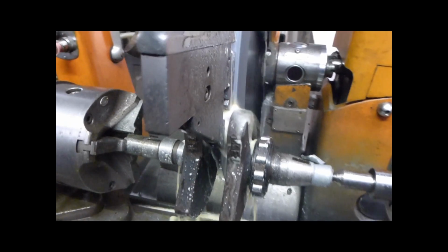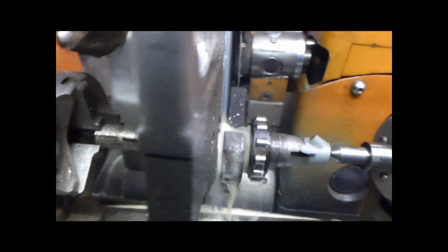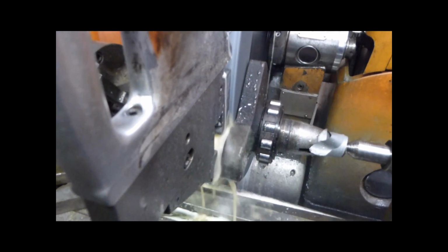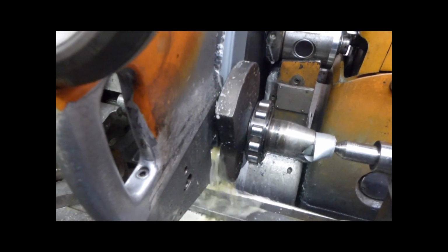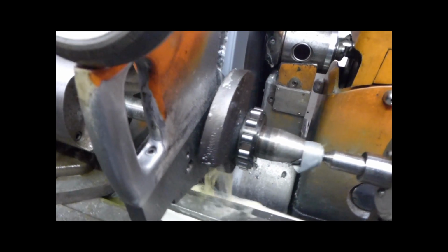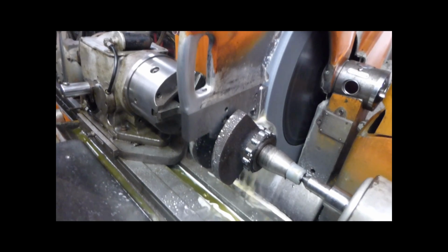That's it, that's just up inside now, see? So now I've got to let it go one turn round to clear it, like a full width. See, when I'm winding across, it's stuck in a spiral. Well, when you get to the end, you've got to let it do one turn, at least one turn, so it grinds it all the way. Yes. A full width.